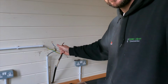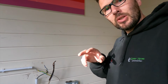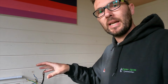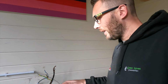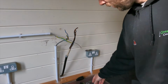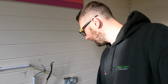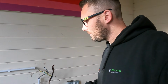So in the previous video, I showed you the other board that we had mounted here. It was a little garage consumer unit that was a mix and match. We had basically a Hager, it was a Square D board, with a Hager MCB jammed into it. Doesn't even sit on the DIN rail. Very, very bad installation. No labels, no nothing. And in fact, the actual supply for it wasn't terminated in the slightest. If you follow us on Instagram, you would have seen me moaning about that good and proper. Lack of effort from the previous Sparky.